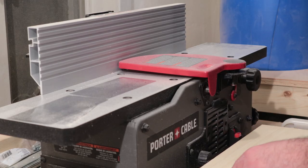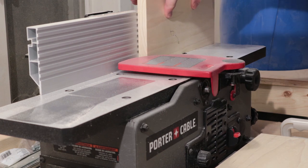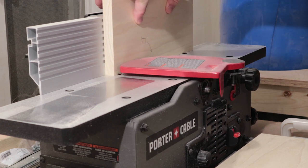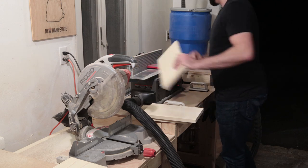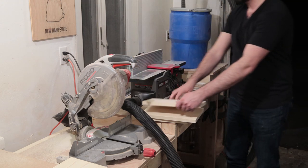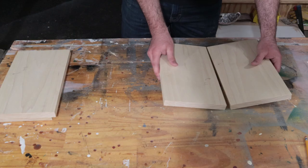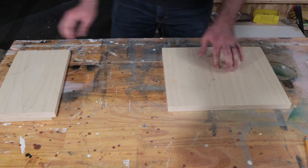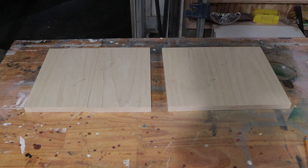After the four pieces were cut out, I took them over to the jointer to flatten out one edge of each cutoff. This will make the edges nice and tight for the glue-up. If you don't have a jointer, check to see the fit first. If there are some gaps, you might be able to skim a little off the edge with your table saw, and if that still doesn't do the trick, I'd recommend building a jointer jig for your table saw. There are a ton of videos out there on these and it'll definitely come in handy for future projects.